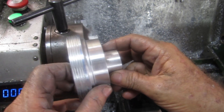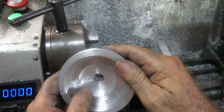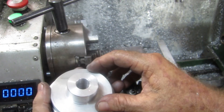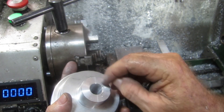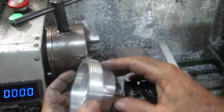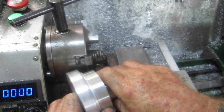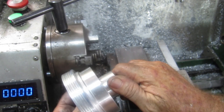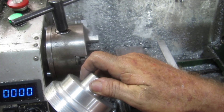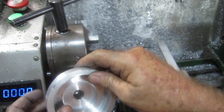Well viewers, I've got to admit this is not one of my better castings. I don't know if you noticed in that first bit where I was pouring it - it got really gassy and was just blowing out everywhere. I'm glad I made it a bit longer than it was because there was a great big void in the end of it - it was terrible. It's got a lot of bubbles all through it, but that doesn't really matter. This has taken three days so far to replace this thing: a day to make it up and dry the plaster, then yesterday I poured it and machined most of it up, then finished this part of it this morning.